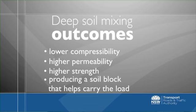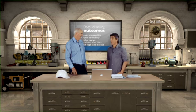This sounds like a magic box — just drop the auger down, spin it round, pump cement through it. What could go wrong? Well it's not quite that easy. Because everything's happening 30 metres below the ground, we use very specialised firms with computer controlled equipment that are able to monitor and measure the rates of revolutions of the cutting head, the pressure the cement's going in and the withdrawal rate, so that we get very tight control over the process down under the ground.